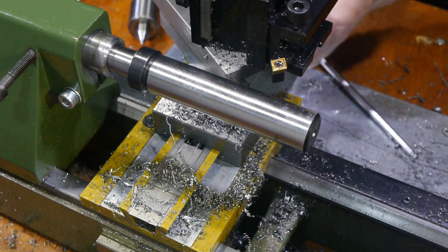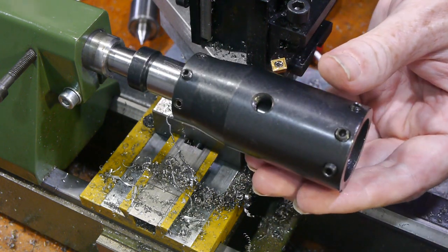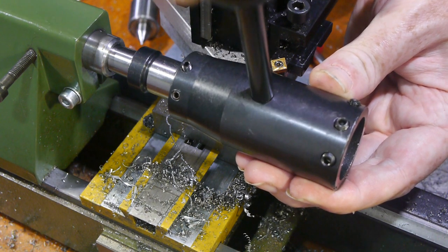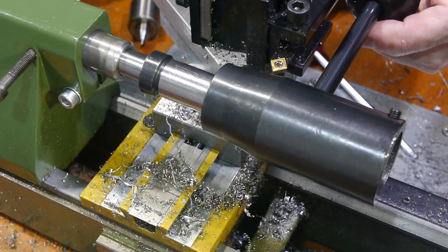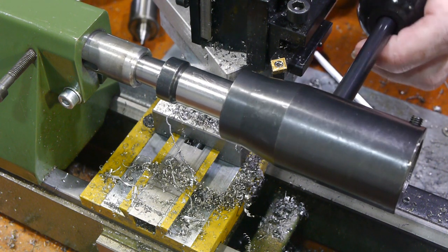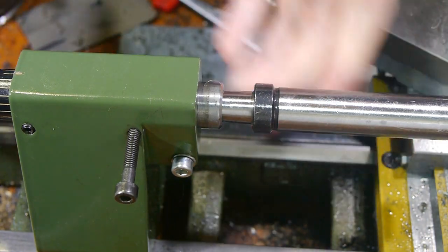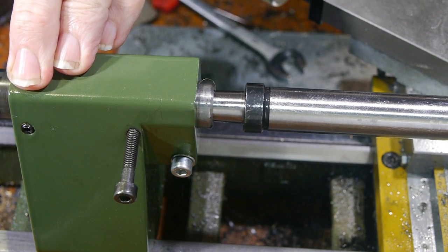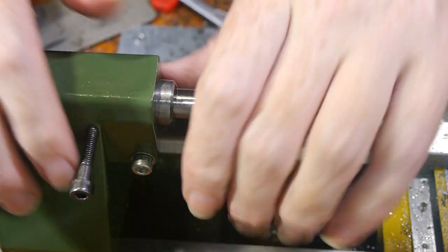It turns out to work just fine. The shaft sits nicely in the taper, doesn't wobble, and the tailstock has no problem with the weight. There is a problem, however. When I retract the tailstock, the shaft isn't pushed out as it should be. I cut it a little too short, and as we all know, there's no way to put material back.